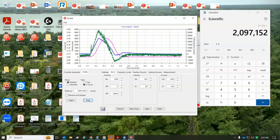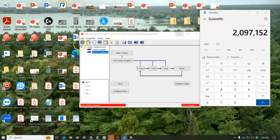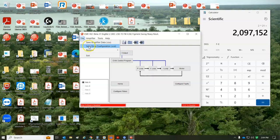There's cog compensation in the Copley. We could use that. That's a benefit or a feature of using a Copley, plus the cross-coupling features that are very popular and pulse at position for lasers, even though the EtherCAT Master might not be able to do it. Copley can.